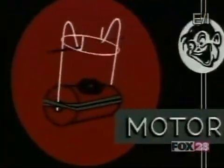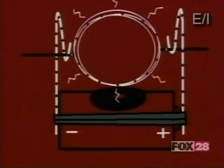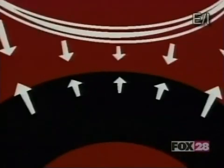Here's our motor hard at work. Electrical energy from the battery makes the coil into an electromagnet. Our electromagnet and our refrigerator magnet push each other away, and that starts the coil turning. Scraping off only half of the enamel turned the wire into a kind of on-off switch. When the bare half of the wire touches the clip, the switch is on and the magnets push apart.